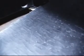And then I'm going to rest the head of my ratchet. I can get it together. I can rest the head of the ratchet in that gully right there. You can see there's an actual trough to set your ratchet in. Sorry, it's probably not the best lighting down in there. So I've got the Allen wrench head down in it, set well. And I'm using the divot here to rock my ratchet head back and forth in. While I'm keeping downward pressure, I'm pressing down, to make sure it doesn't strip that screw head out, that bolt.